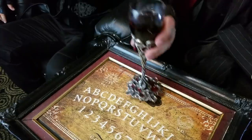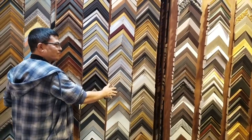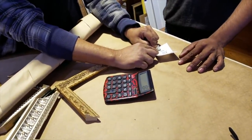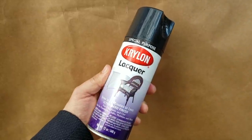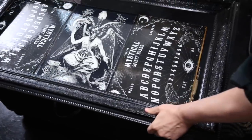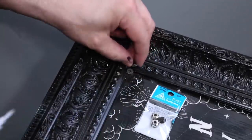The haunted library table from several episodes ago had an ornate frame for a top. To keep with that theme, I took a walk to an East Village framing store called Excel Custom Framing. They had a huge selection, but all of the best stuff was hidden behind moving walls. The staff was really accommodating and let me rummage around until I found a frame I liked. I gave them the dimensions, they gave me a price, and one hour later I had this amazing custom frame. I grabbed my Krylon black lacquer and painted it black. With my industrial glue gun, I laid a bead of glue all the way around the perimeter of the tabletop and laid my frame in place. I wasn't sure hot glue was going to hold it, so I drilled some screws into the corners. To hide them, I went to Toho Shoji in Manhattan and from their enormous bead collection found little gems that I glued onto the screws to hide them.